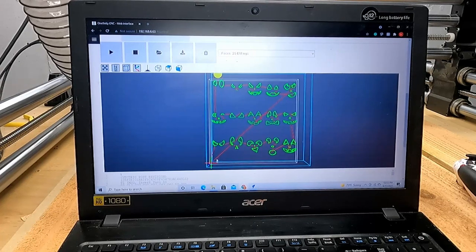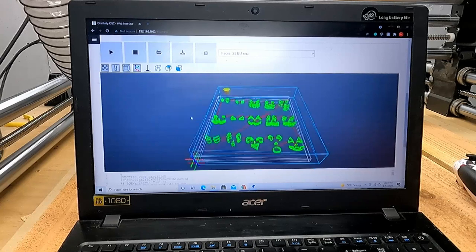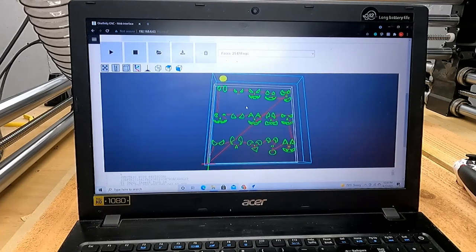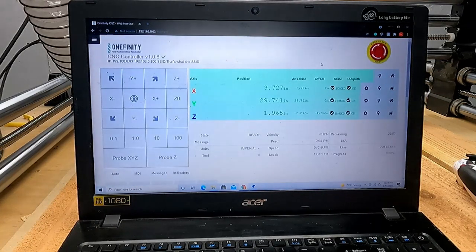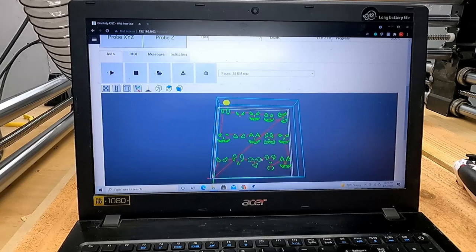And then also, right there is the start of this file. If you create multiple files, there might be other starting points. That is our zero reference. We've already set it, so things look good. We're not getting any errors because if we had set a center point reference, it'd be throwing up errors everywhere thinking there's no way this file is going to fit because you're in the center and you don't have 32 inches this way or this way. So that's a good check too.